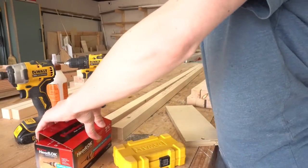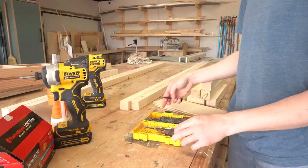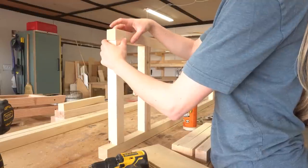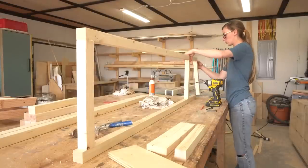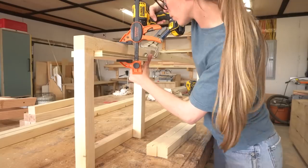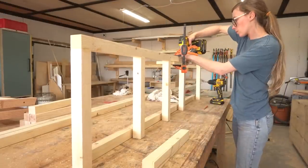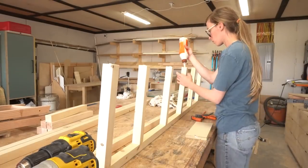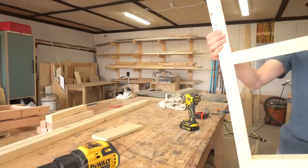To assemble the shelf frames, I used timber screws. I've used these before and they're great in that they provide both structural strength and a decorative detail. Because these are rather large screws, I made sure to pre-drill before driving them since 2x2s can split pretty easily. I used wood glue at every joint, and after I got the top and bottom rungs in place, I used a 12-inch scrap wood spacer block to evenly space all the rungs. In hindsight, I wouldn't use these screws for this situation again — I'd use basic 3-inch wood screws and just putty and paint over the holes, as they didn't show up in the end product enough to justify the extra expense. I assembled two identical frames this way and set them aside.